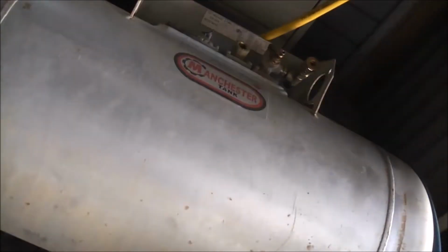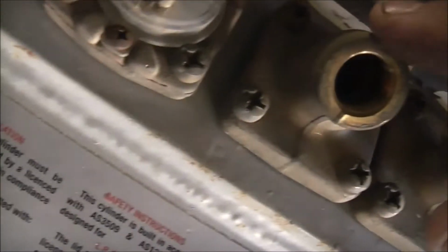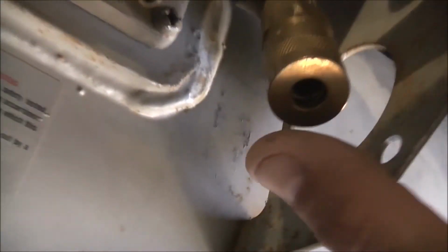I've turned this propane tank into a little portable air tank. I'm going to set that bracket the other way and put some wheels on it and make it portable. And this will be the top. That's the top half. That's the filler hole, which is a one-way valve. Fill it from there, and suck air out of there. Plug your hose until I've got a portable tank. So I can plug it in there as a booster tank if I need more capacity.